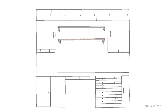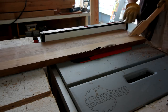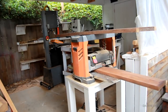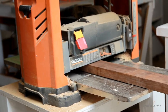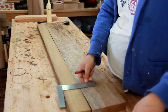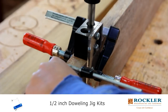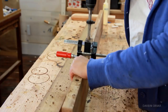One of the last larger things to finish are the middle shelves. For those we're using some beautiful sapele, trimming them on the table saw and then planing them to get them nice and straight. The pieces were not quite deep enough, so we glued two pieces together, using dowels to line them up right. A little jig like this really makes it a lot easier to make sure everything goes right.